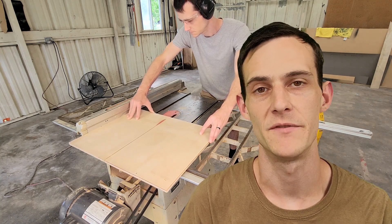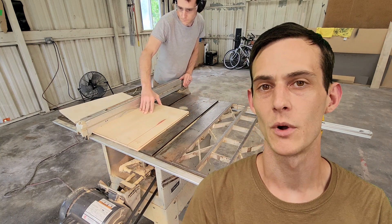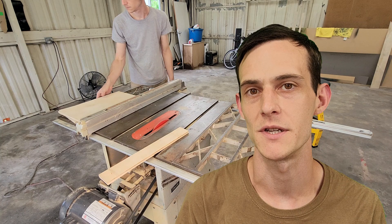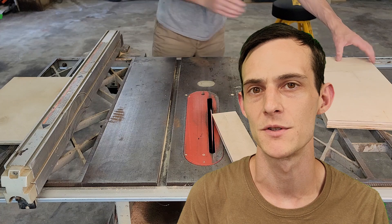I'm going to take some half-inch material and rip it up and create what are called window braces. What these are going to do is tie all of our panels together and raise the resonant frequency of each panel. We want to raise this frequency above the range that our woofer is going to be playing in, thus eliminating most of the audibility.